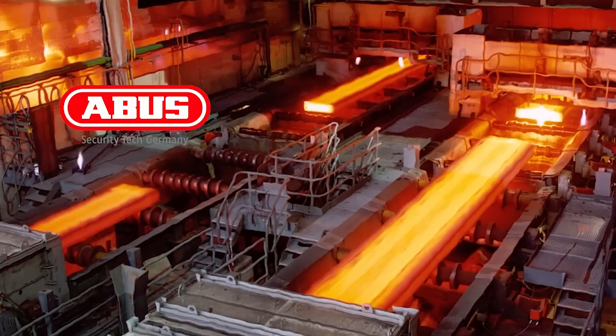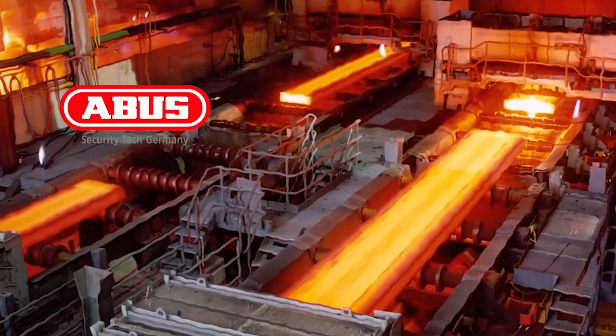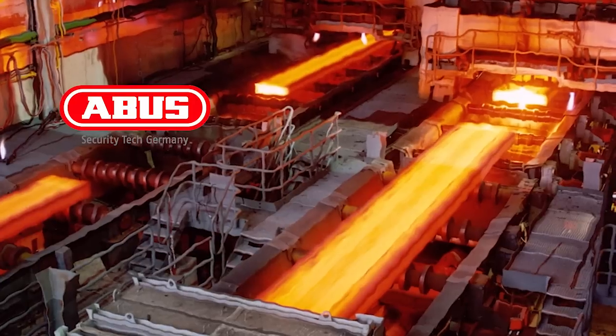To build our alarm disc locks, ABUS starts with high-quality virgin steel that's temper-hardened for strength, flexibility and weight. This steel is used throughout the lock, from the shell to the internal parts. ABUS temper hardens its steel, which is more expensive and time-consuming than standard case hardening because it yields a stronger, lighter material. It progressively hardens the steel from the outside in, so the inner core remains flexible while the outside is super hard.